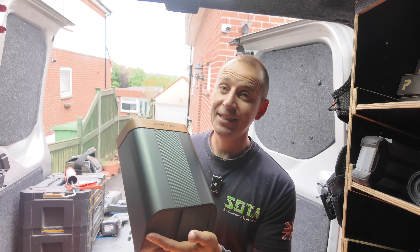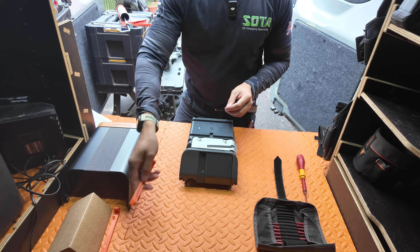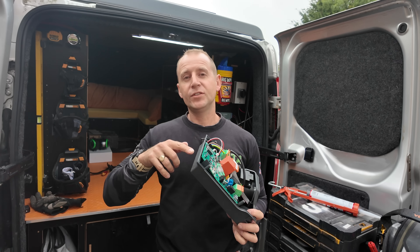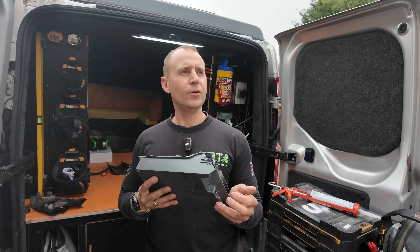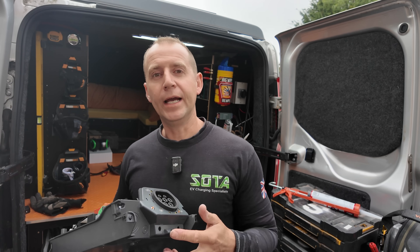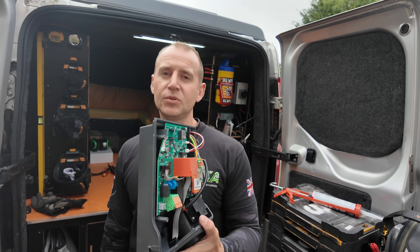Installing this one is a piece of cake. To remove the front cover all you need to do is undo two screws at the bottom - there's a third one to remove as well - then remove the side brackets and the top just slides off. This charger looks very similar to the Anderson Quartz but they are different - I'll leave the Anderson video in the description. What's different here are the cable entries: bottom entry and rear entry, you can drill those, put your stuffing gland in, mount it to the wall, and bang your cable straight in. Easy - lever terminals, a couple of connections for the CT.